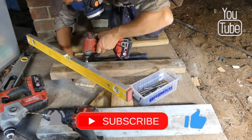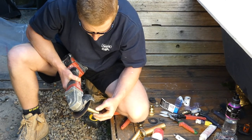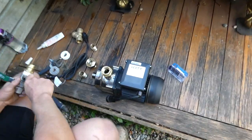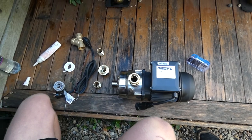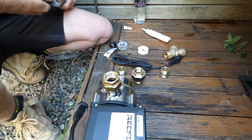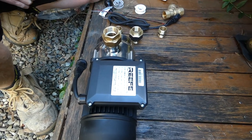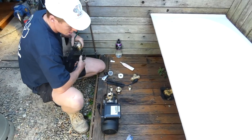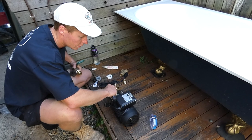I had no idea how to connect the water chiller to the bath, so I spoke with Cole and he came up with a smart design to circulate the water from the bath through the water chiller and back using a transfer pump. It's not a multi-stage pump — it's a transfer pump. A multi-stage pump will cut off once you basically stop the water supply, so it would continually run and cut in and out. This one will just continually run once you turn it on — it won't cut in and out.